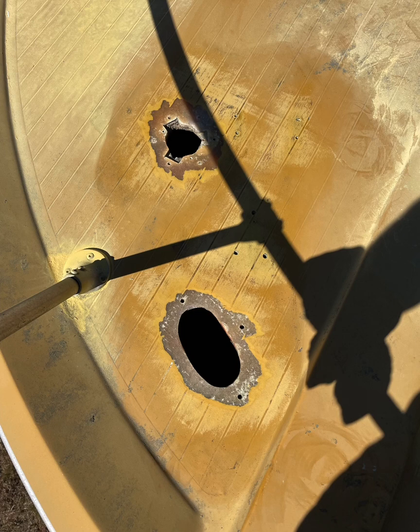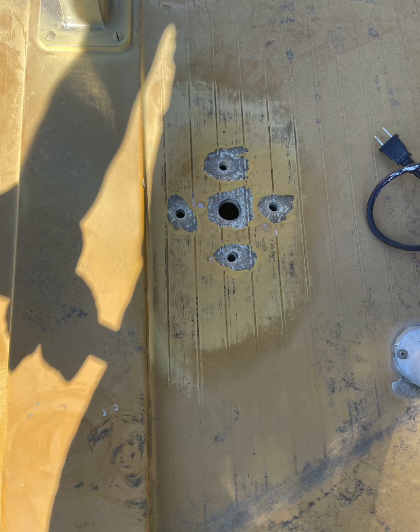Old holes in the bow where the anchor locker used to be and the old anchor rope used to drop into. I'm having a different system, so I've filled those in and ground them out to fiberglass them. So I filled them, fiberglassed them, and as you'll see later, I did some fairing compound over top.